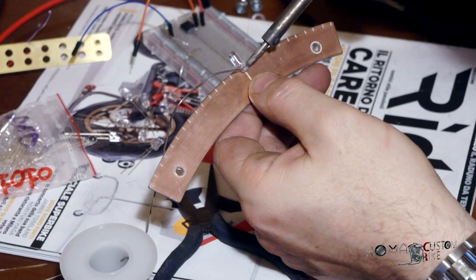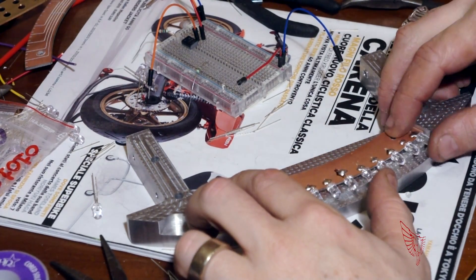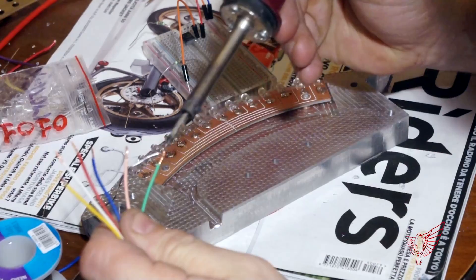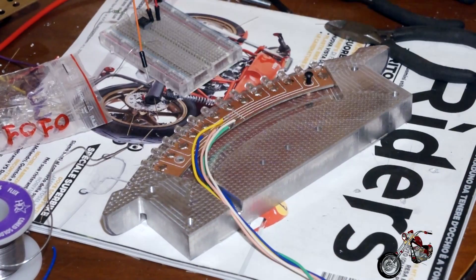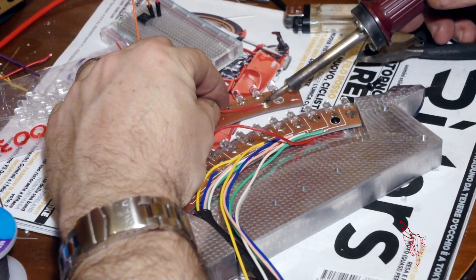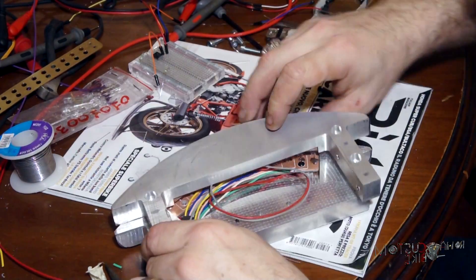Positioning the LEDs on the taillight board is the most crucial task in this assembly. I've spoken about the design of this board in the previous episode, but to briefly recap, I've marked the board with the position of the two extremities of each LED so I have a reference for the installation. Once the assembly of the LEDs is finished it was time to hook up all the wires. A lot of thought went into designing these pieces — even the notches for the wires are rounded so they keep them from scraping against a hard corner. The top side is also assembled and since it's an entire row of red LEDs only two wires are required. The carved spacers have been designed to keep the boards, and consequently the LED lights, at the right distance between each other, while leaving enough space for the solders and the wires.